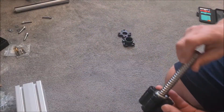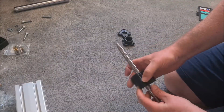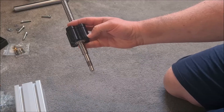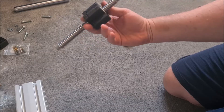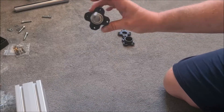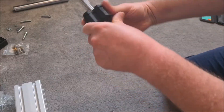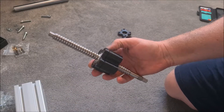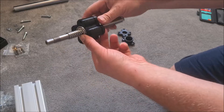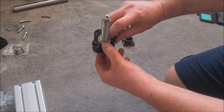I've redesigned the centre of the slider and the two sides of the centre of the slider, made the hole a little bit bigger and the keyway a little bit wider. They're still quite tight but they fit nicely now. The way the slider builds up, these three elements go onto the ball screw.